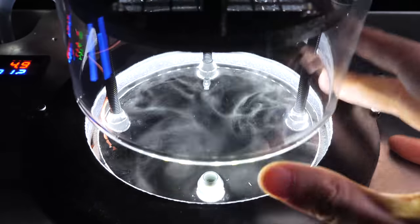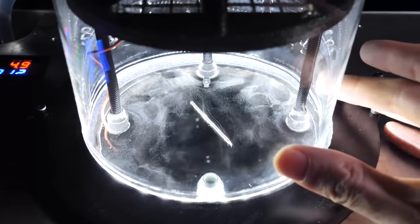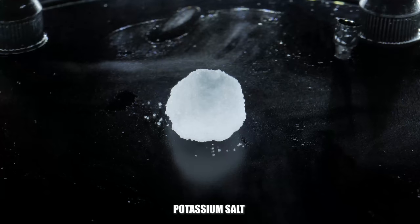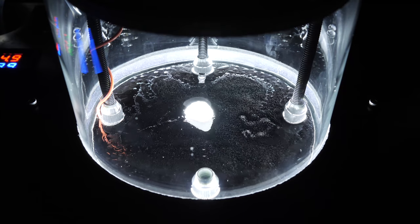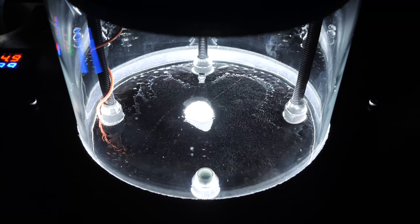Obviously, we have to show a few other things that everyone knows to be radioactive, like thoriated welding rods and potassium. You can try a banana for potassium, but you really won't see anything. That's why we went for the concentrated potassium salt. For all you machinists out there, there's a pretty cool piece of metrology equipment that I wish I could get my hands on, called a beta thickness gauge. It uses a relatively strong beta radiation source, that's electrons and positrons, to get a very exacting thickness of things like paper by detecting how much the paper blocks the radiation.